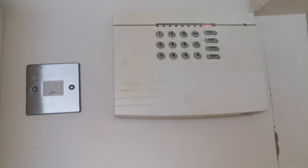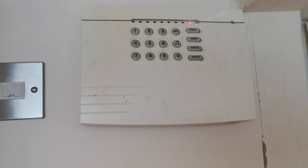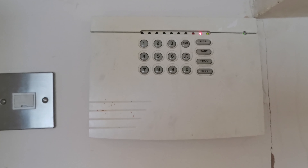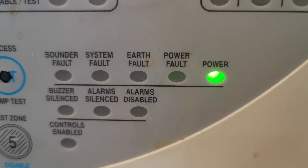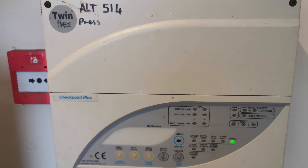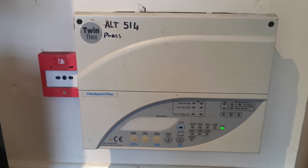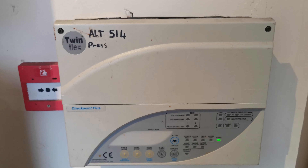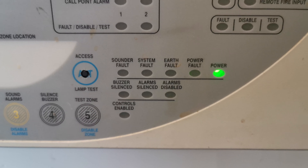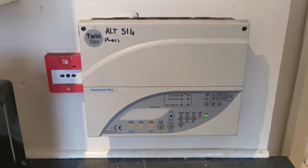We're out at a property in Leeds where there's an alarm panel fault. The tenants called up the letting agency and said that the alarm panel keeps going off, and we're just going to investigate why. We've restored power to the panel — I think there must have been a power cut. We checked the default password and it works. The fire alarm panel was showing a power fault, which generally tells you there's no power to the panel itself or the battery has gone. The green power light was on, so we knew there was power there — so it had to be the 12 volt batteries.